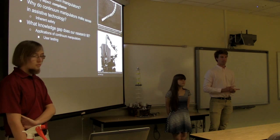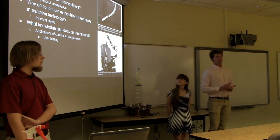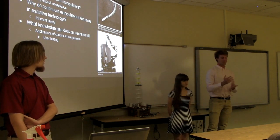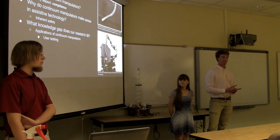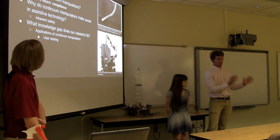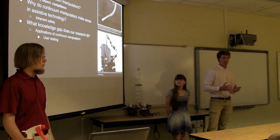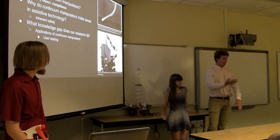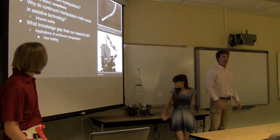In order to achieve this capability of continuous bending, these robots need to be constructed of compliant materials — you need a material that can bend a little bit. Additionally, because they can bend continuously, these robots have infinite degrees of freedom. These two aspects — the infinite degrees of freedom and the compliant materials — imbue them with the quality of compliance, which means these manipulators will conform to their environments.